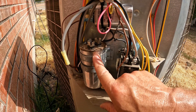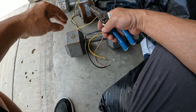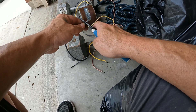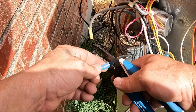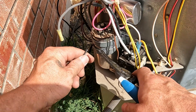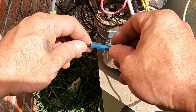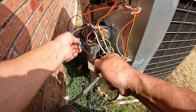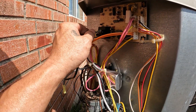We don't have the compressor hooked up right now, we do have line one and line two hooked up. I completely forgot about that extra relay in there - I'm just going to cut a piece off the old fan wire. All right, we've got an extension. The black wire from the fan - I completely forgot it goes up to this relay instead of to the contactor. Crimp this on there and run it up to the relay.